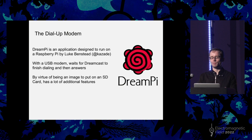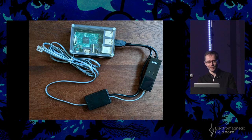By virtue of the fact that this is essentially a plug-and-play solution, it comes with a lot of useful features. Some games have DNS servers hard-coded, and DreamPi forwards those requests onto IPs run by the community so that games can find games to connect to. It also supports a service called Dreamcast Live, which has clearly taken some inspiration from Xbox Live — once you register for an account it shows you who's online, what they're playing, and that type of thing, making it much easier to actually find games to play. This is my DreamPi: the Raspberry Pi is at the top, the USB modem is to the right, and then there's a mysterious black box at the bottom being powered from the Raspberry Pi. That is simply providing voltage on the phone line, because the Dreamcast modem is expecting to be plugged into a phone line, not another modem, and it needs that voltage in order to function.